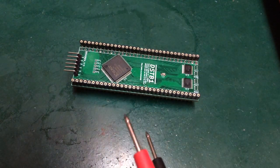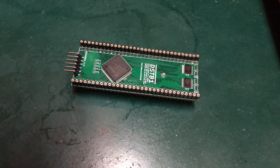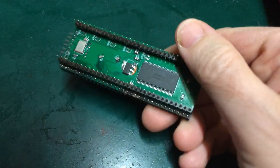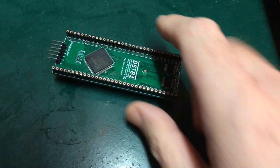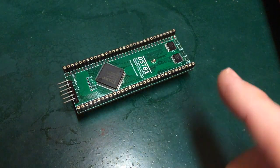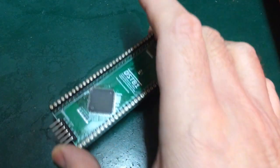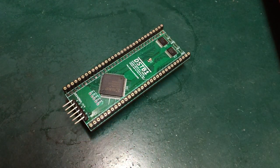But when working with the SDRAM, I ran into a problem that one of every fourth address was returning the same thing as the address prior to it. Normally that would imply I've made a mess of the logic for the SDRAM down here, because I've got the wrong pin set up or something. But in this case, there was no possible way. A3 only ever points to one place, so there's no way that could be inadvertently configured for the wrong size memory or something like that.